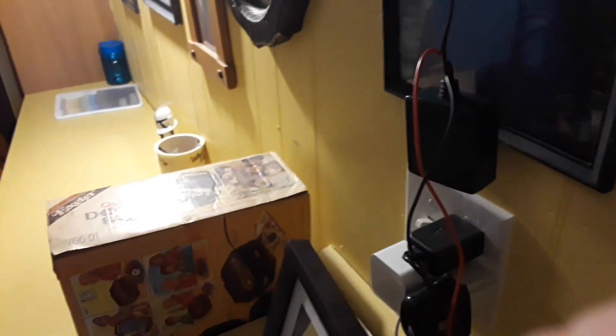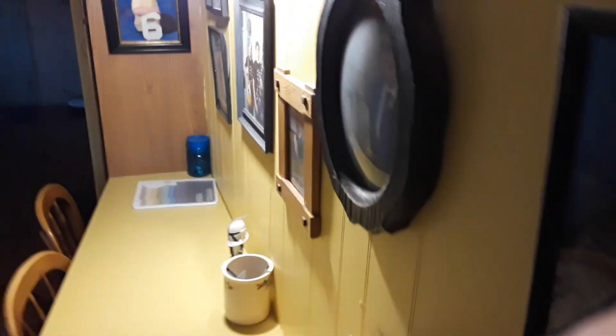We'll turn it on to tone. Now let me get out the receiver, turn it on, and as I put it up to the wires you can hear that sound — that sound lets you know that you are looking at the correct wire for the other end where you plug this in. Hidden behind this large poster is another telephone outlet. It allows me to isolate directly the wire — it doesn't really show up on the green and yellow, but right here on the red and black we're good.